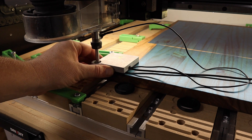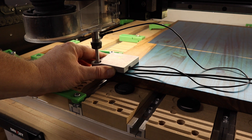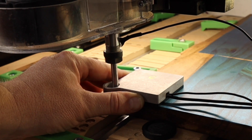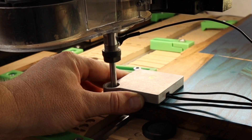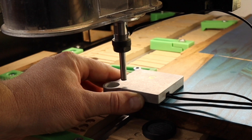What I like to do is hold the bottom left corner of the probe. This isn't necessary, but I like to do it because sometimes as it's probing the X and Y axis it'll bump the Bit Zero just a bit out of alignment off the bottom left corner. Now that the X and Y is done, it's going to go ahead and mark the Z.